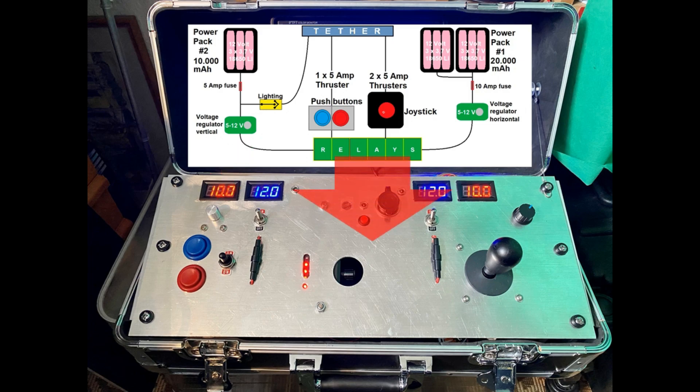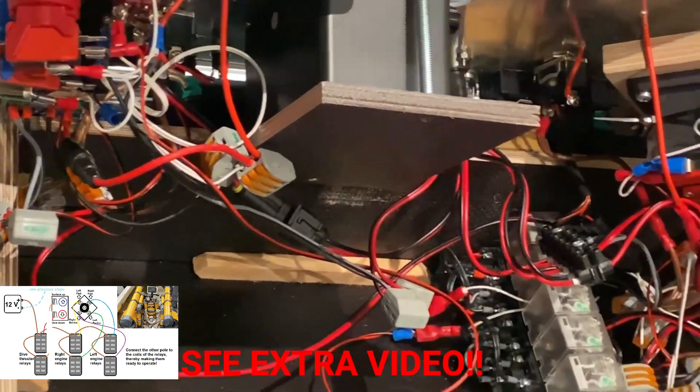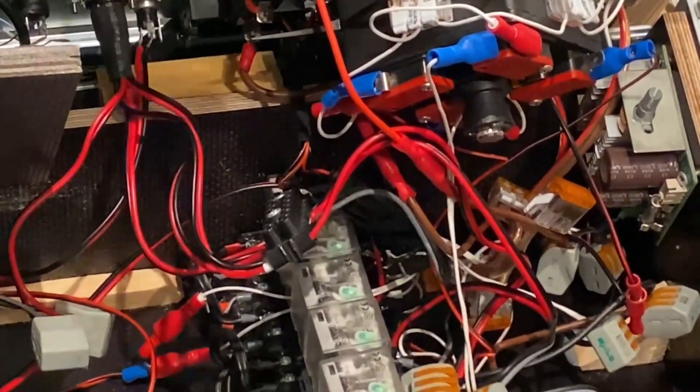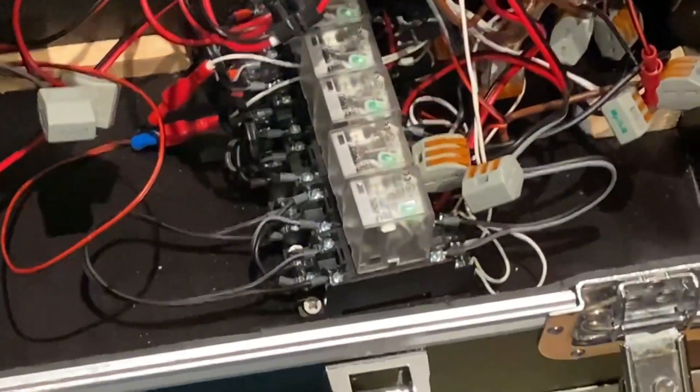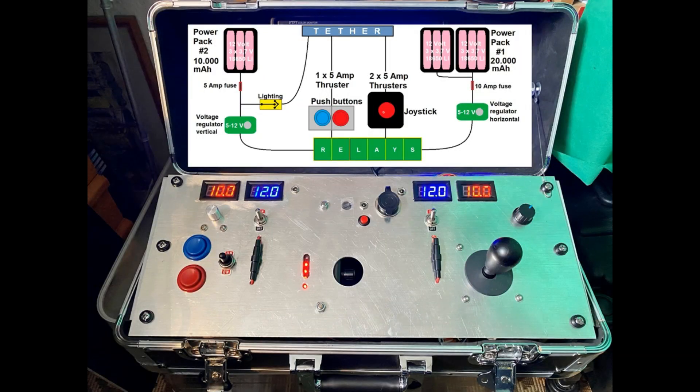All this regulated power goes to the relays in the center. The actual wiring is very tricky — I strongly suggest my other video on wiring your ROV controller step by step, because here you can only see a horrible jungle of cables, but it's really not as complicated as it might look. You'll also see how to wire up the joystick to the relays and the push buttons in red and blue for the diving and surfacing functions. Once you wire up those six relays, the outgoing power goes into the tether via a nine-pole plug with rubber cap.